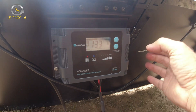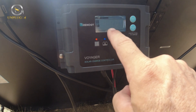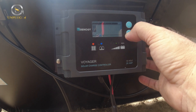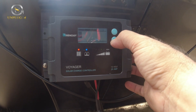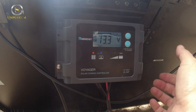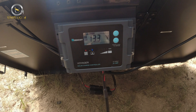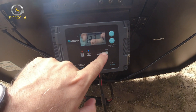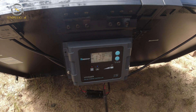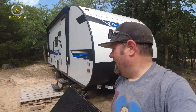You can go in and set your battery type — it's currently set at LiFePO4 at 14.4 volts. You can change it to LTO, gel, AGM, wet cell, calcium, lithium-ion, and back to LiFePO4, so it'll charge any of these battery chemistries. It's important to set your battery chemistry for whatever battery you have. It also shows your current battery level with four LEDs — the green light is on LED number three, so it's about 75 to 80 percent charge.